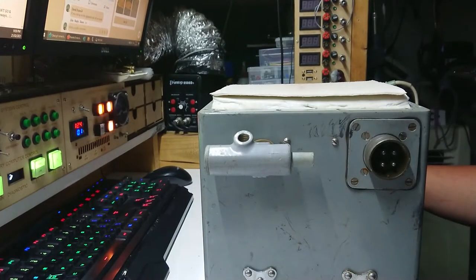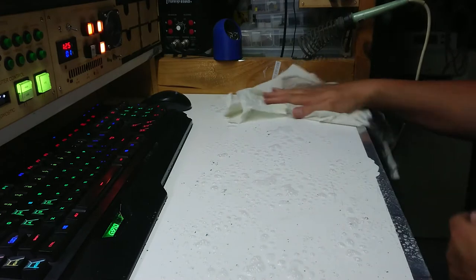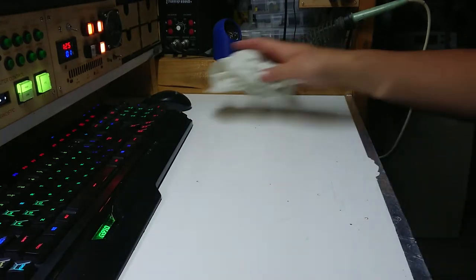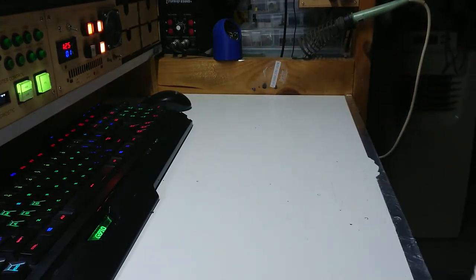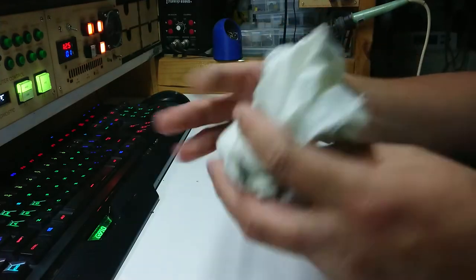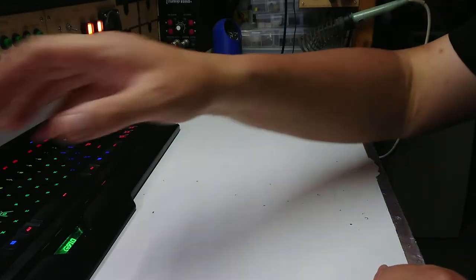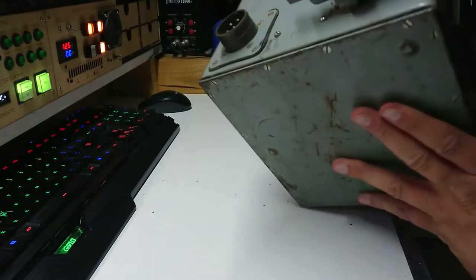For those of you freaking out about asbestos: I have moistened my tabletop with spray and wipe, I'm using a rag which I will discard to pick it all up so it doesn't get loose, and I have turned the air conditioning off so I'm not blowing it around. I'm keeping the air very still in here and making sure I wipe down my arms and fingers, because the stuff can go through the skin a bit like fibreglass can.